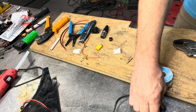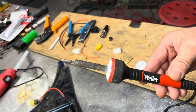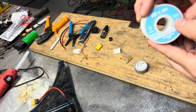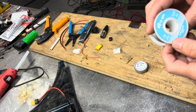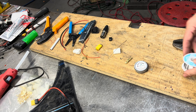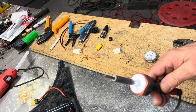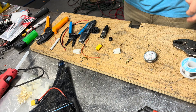The solder I'm using is just a basic Weller. I'm a welder really, I don't do much soldering so I don't have anything fancy. The solder has flux in it — it's 60/40 and it's 0.8 millimeter, that's what I like. Tip tinner keeps your solder tip hot because if it turns a dark color it won't solder anything.